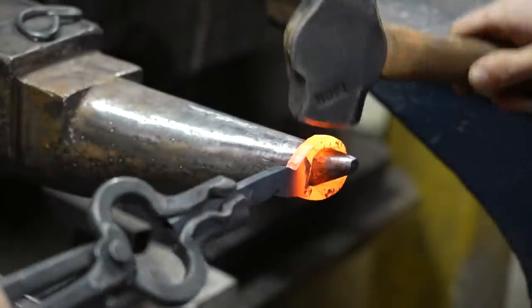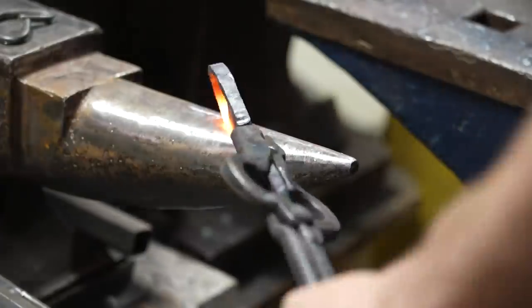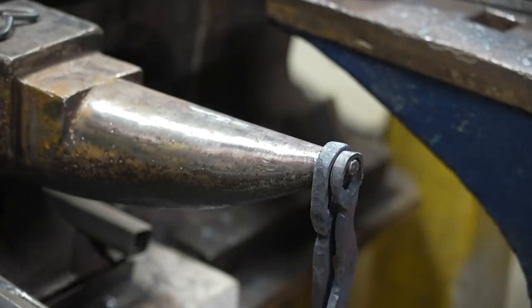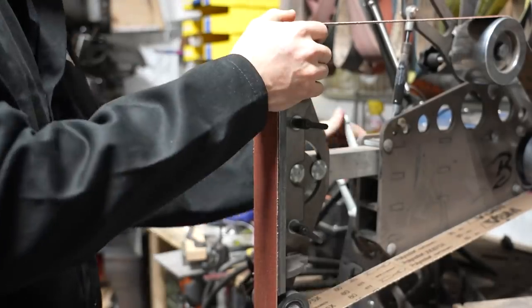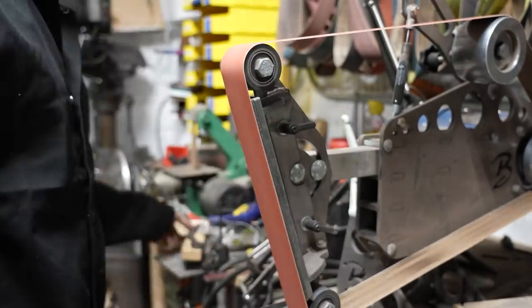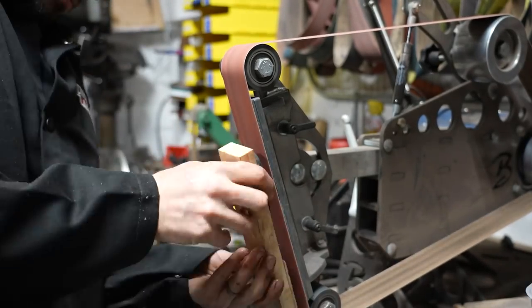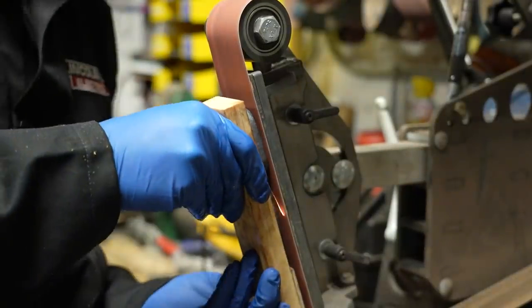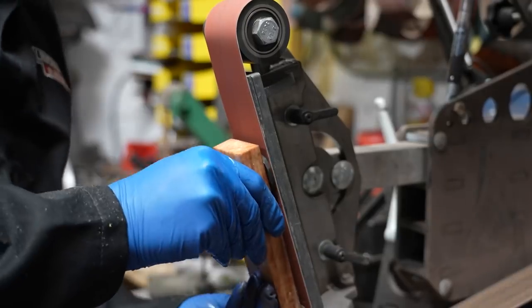The last thing I did was open up the loop on the larger side of the scissors. I had squashed it down so that it would fit through the coil on the forge, and now that all the forging was done, I could bring it to its final shape and make it look nice. I wanted to make both sides of both pieces pretty flat, so I have this little wooden jig with a V in the bottom so it keeps the piece from sliding, and I'm using a 60 grit grinding belt to get those pieces roughed in flat. It took a pretty good amount of time, but in the end I think it was worth doing.